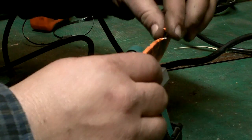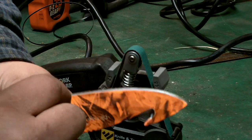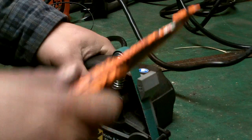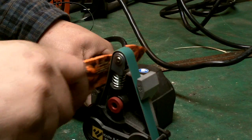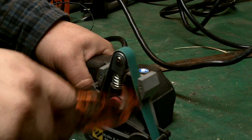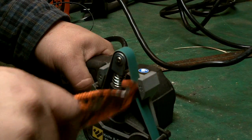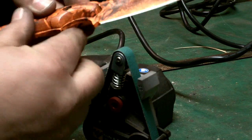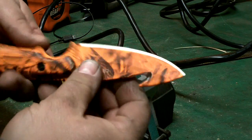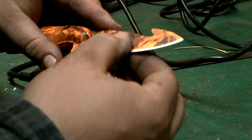And I'll set my blade in here so that the leading edge of the sandpaper falls into where the edge begins. So here's how we go. So we're already starting to see where it's grinding away the excess up here. That was only 4 or 5 times. We're already just a hair past it, and we've almost got the rollover out of the way.